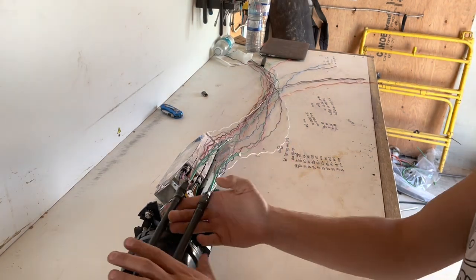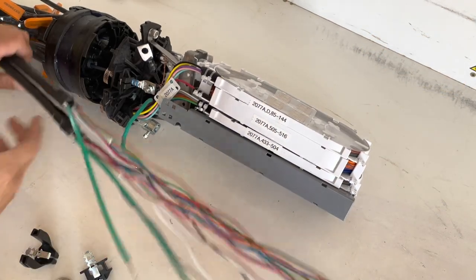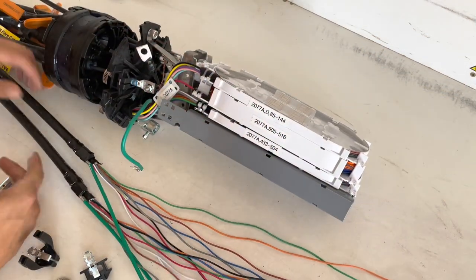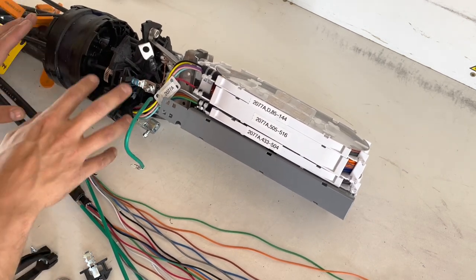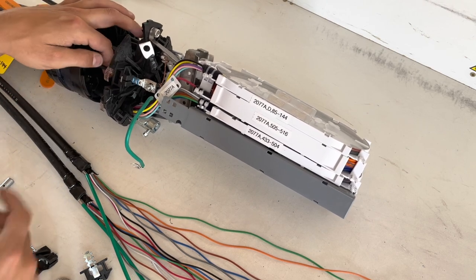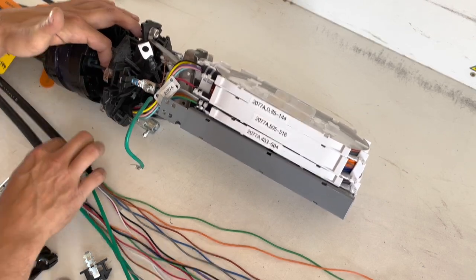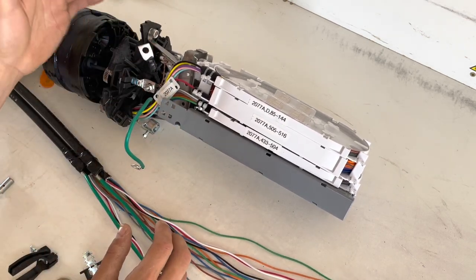So let's get to it. All right. So in order to fit these two cables into this FOSC, we're already pretty full. We have a ground taking up a whole port. So we only have two ports here left after we remove this ground. We're gonna have to insert this ground with one of these cables in order to fit everything in here and still be able to ground the inside here.